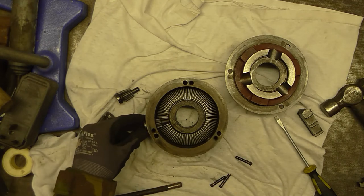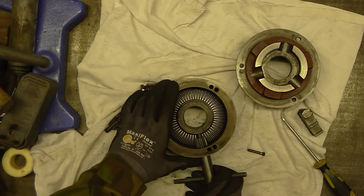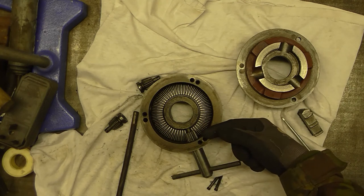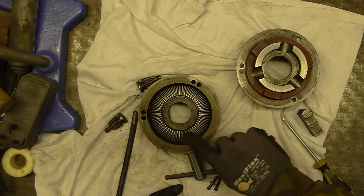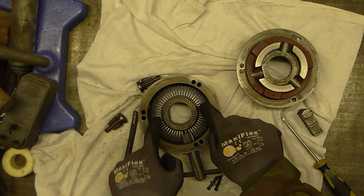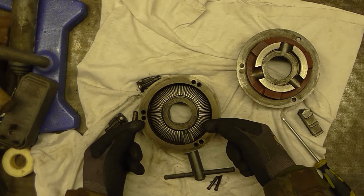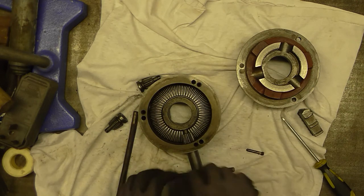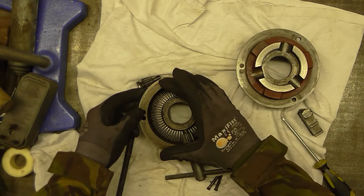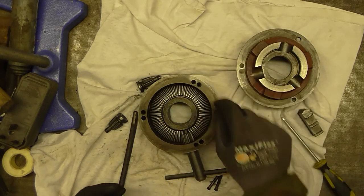Now when you've got one of these bevel gears in there, in an ideal world when you turn the bevel gear you're purely rotating the scroll. But of course there's a force that's simply sideways — it's being constrained on the register causing it to rotate, but any slop between the scroll and the register means that when you turn this it wants to move sideways. This is why if you go around all three points and get tight on this part, then put the same force on the key at the next one, where the scroll's been jammed one way and binding, going to the next point moves it the other way, pulling it out of that bind and allowing it to rotate a little bit more. You go around to the third position and you can do it a little bit more.